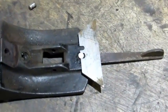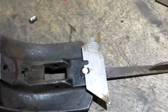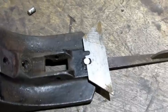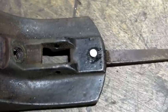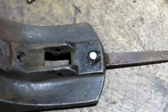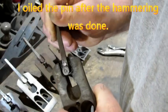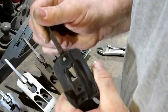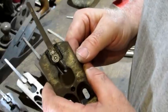What you didn't see was I had to enlarge the notch so it would fit over the pin. That held the pin some distance away from the metal underneath when I initially peened over — mushroomed over — the front side. Then I removed the razor knife blade, gave it a few more hardy whacks and mushroomed the underside. So now the pin is in there tight, the lateral moves, and the pin moves at the same time in the frog. I put some oil on it — the pin is tight in the lateral and turning in the frog.